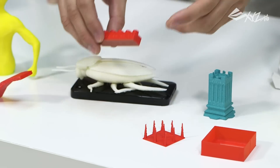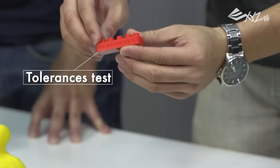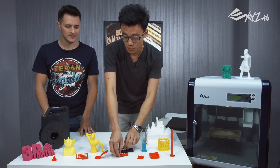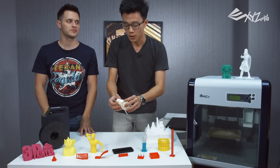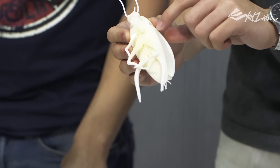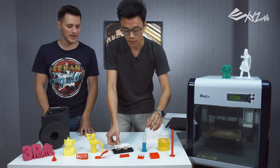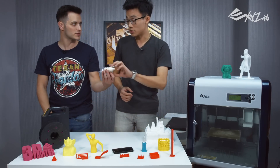What we have here is the negative space tolerance — it tells you how well it prints between those gaps. If you want to print something like this with mechanical parts, like this gear, you want to do it in one print, but it still has to be movable. You want to know how to set your printing and the gaps in between those parts — this is going to tell you that. And that was all one print — you didn't have to print out any piece individually.